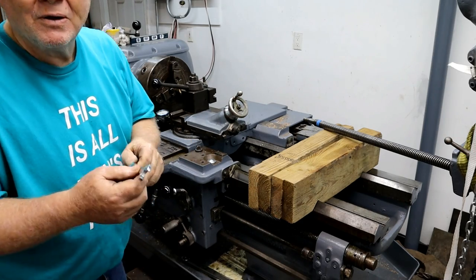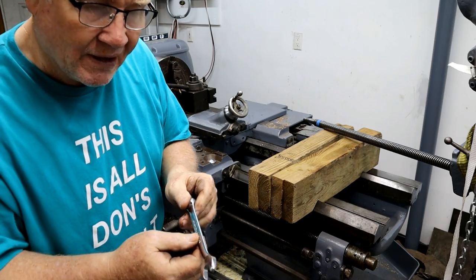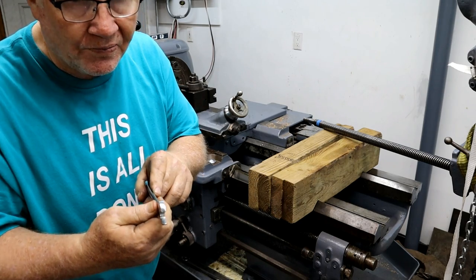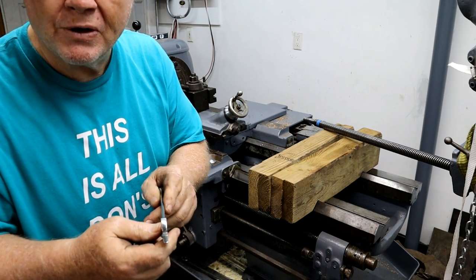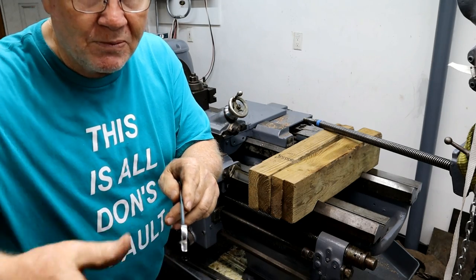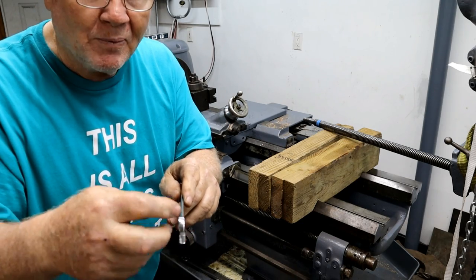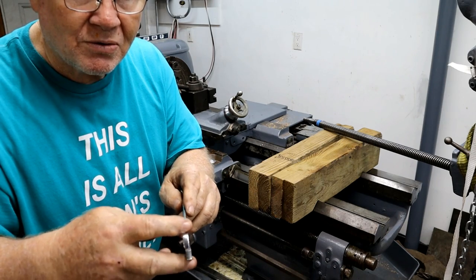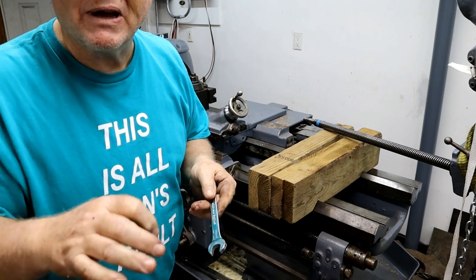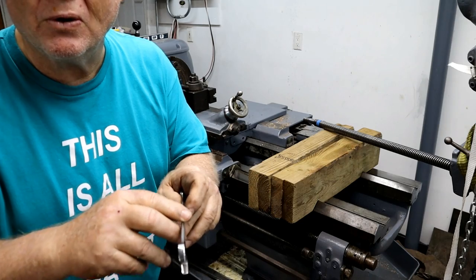Taking spring passes. When you're going into a 3-inch deep thread, cutting big Acme threads, the tool pressure deflects the bar away. Even though that's a carbide bar, which is better and a good insert for that material, the pressure still pushes away. If you just keep dialing in to take more off here, your screw gets looser out here, but you're cutting a taper thread. So once you get the nose in of that screw, you know you've got it on the right diameter. So work on refining the threads deeper into the hole.